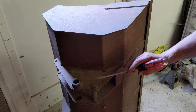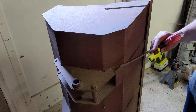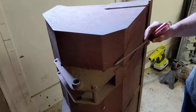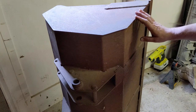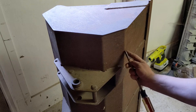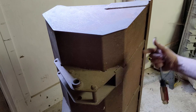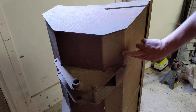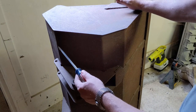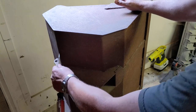This is the line we were discussing. Fundamentally, the bucket has an extra protrusion — an extra bend right here — that we really don't need. I want the steel to bend here and run directly flat to this point. To make that happen is not terribly complicated. First, we have to cut these old attachment ears off completely, so I'll go after it with a cutting torch and skim as close as I can without penetrating all the way through. Then I'll set up a straight edge, probably leave this bend in place, and cut off a half an inch this side of the bend so it acts as a flange. We'll do the same thing on the other side.